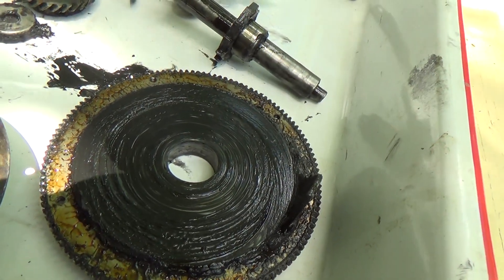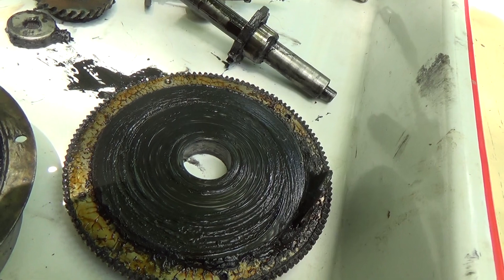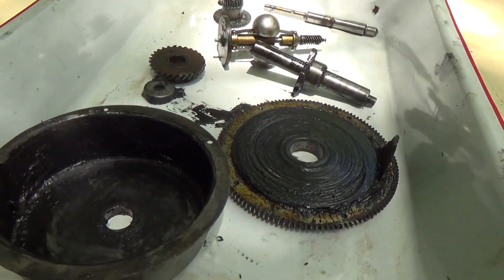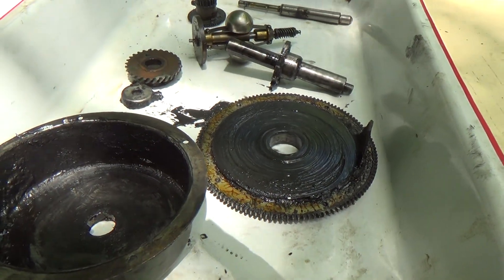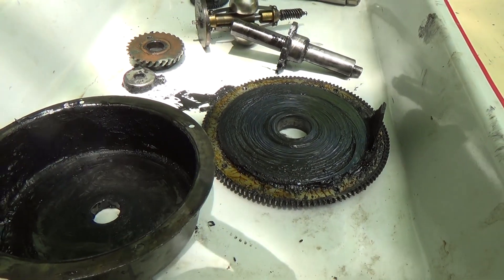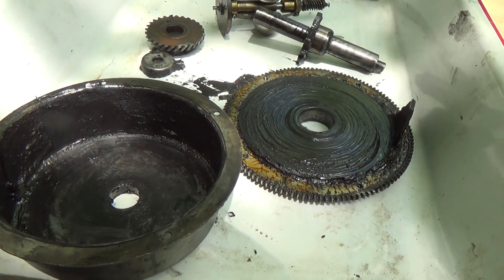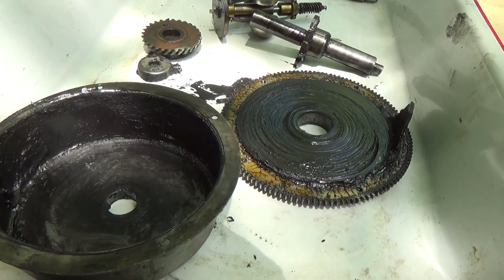That grease is nasty-looking — but really it's basically Vaseline with black graphite powder in it. That's what they used in the old days. We have better alternatives today. Even the cheapest grease we have today is still going to be better quality than what they had in 1924 when this motor was made. There'll be endless fights over what's the best oil, what's the best grease — they all work. For an original spring that's a smaller one like this — it doesn't really apply to bigger machines with heavy springs — you're going to want to use a light grease, like white grease, and I cut it with STP engine oil lubricant to thin it out, because a weaker spring can be held up somewhat by thick grease, especially in the cold, reducing the power of the spring.